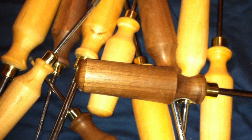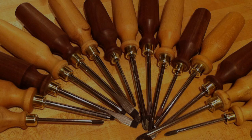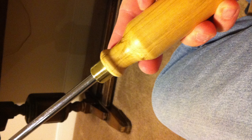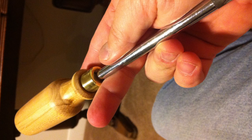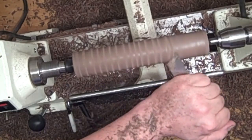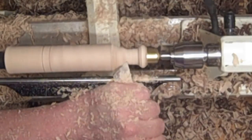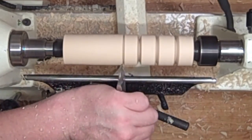The trick for me in making practice fun is to pick small projects that will exercise a certain skill. In order to learn to use a skew effectively, I'm choosing to make a couple sets of screwdrivers by only using the skew. The reason is it's cheap, fairly quick to do, and making tool handles is something I'll be doing my entire life as a woodworker. It forces me to use all the cuts a skew chisel can do: planing, peeling cuts, scraping cuts, and slicing cuts such as V cuts and beads. So this will be the perfect project to learn the skew.